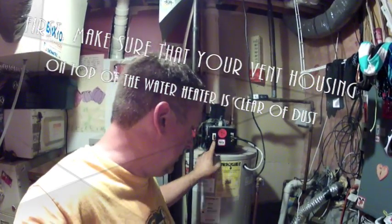If you're positive that you're hearing it light up and then shut right back off again — the fan's running, it draws the air out — you're going to see the flame light up, hear the valve, and then there it is. That piece is a bit loose because I was in there just before this video. There, it shut off. The sensor failed — it said there's no flame — and then the machine shut off the gas, which is probably a good safety feature.